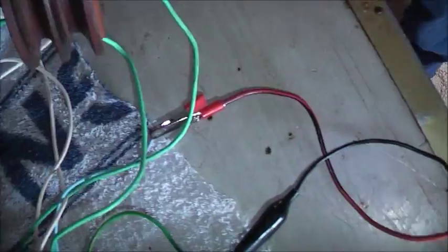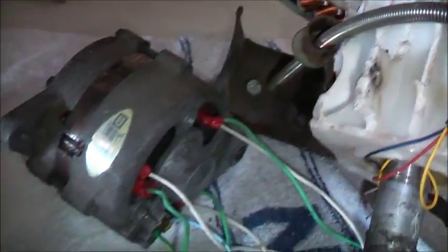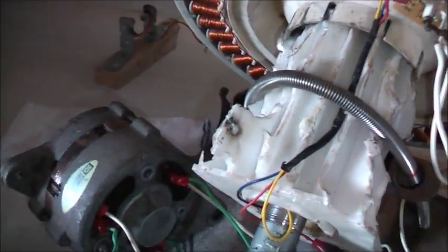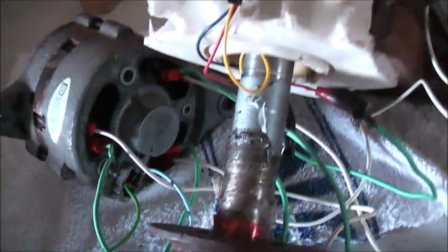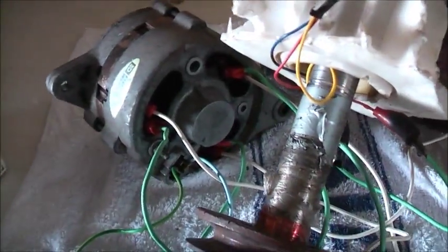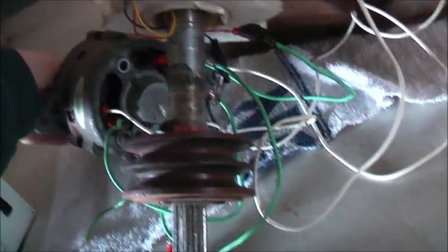This is an AC output — I've got to rectify this thing so it's DC. I need a three-phase rectifier for this, so it's pushing it one way, but I'm twitching it backwards and forwards in AC. I need to rectify this generator. I'm building this — I need a pretty tough driver to excite those coils and pulse them; they're pretty power hungry. They're your main charge coils — 12 volts at 30 amps. I think that's where I've wired it up correctly at least, so the outer part of it's done. I've just got to find a proper powerful driver for this thing.